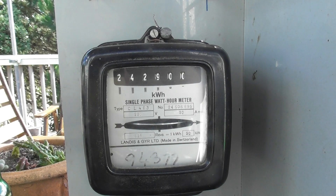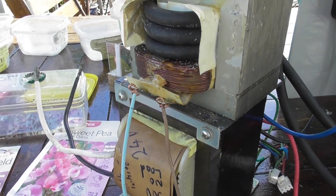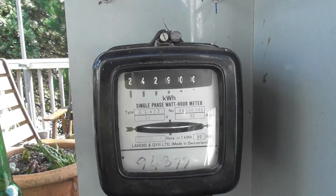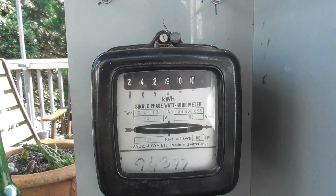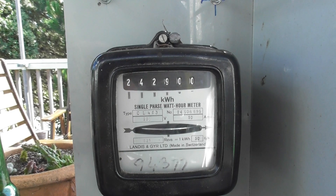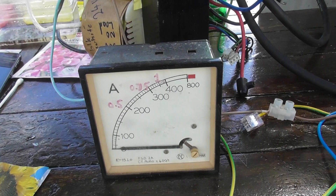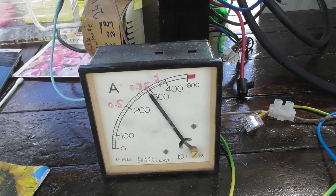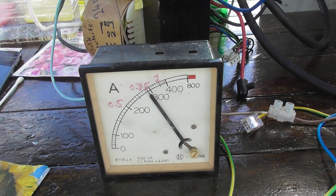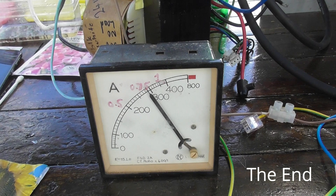You can see we've got the variac at 50 volts on the microwave transformer. The connections are rough and rusty style, just some 1.5 mm heavy-duty cord. I need to monitor the temperatures, mainly of the variac. The variac sits at about 0.75 ampere — that's good — and that meter flies. I'm happy with this. The ratio I need to calculate out is probably about 40 ampere turns on the secondary — fantastic.